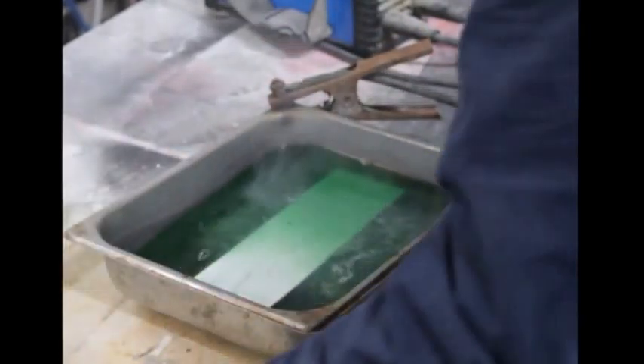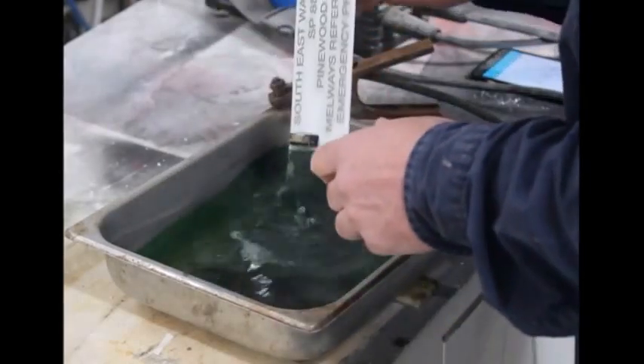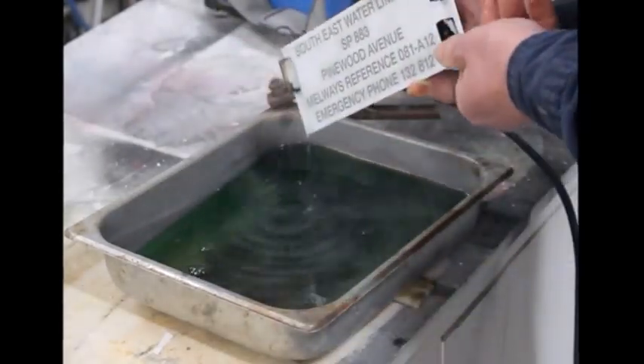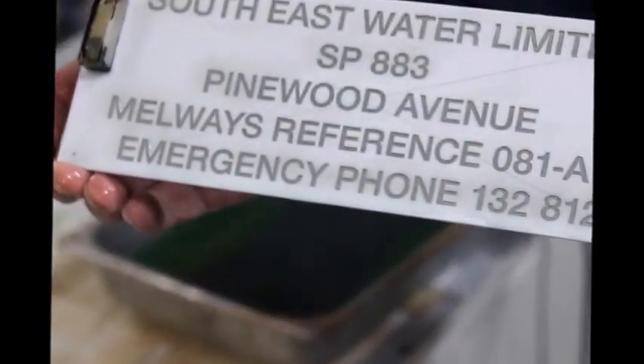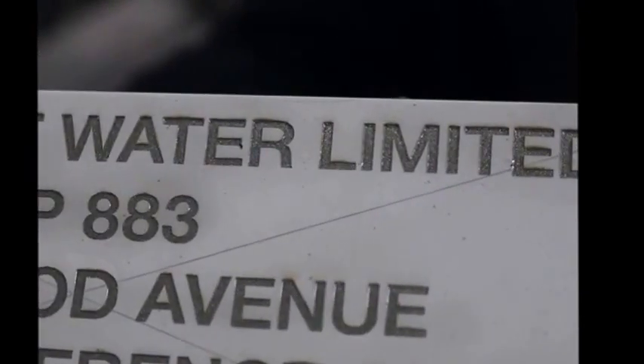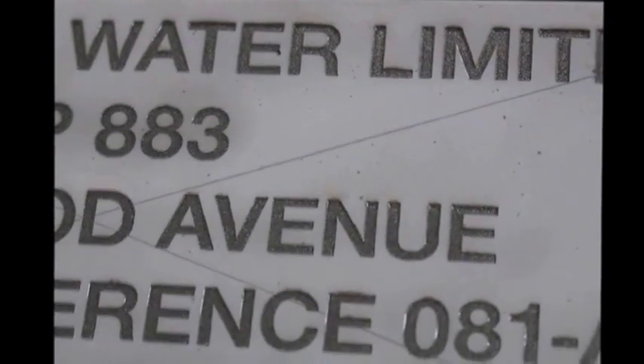After a third minute of etching, I can see that the etching has reached the required depth which is approximately 0.1 of a millimetre. This gives a nice deep etch and it holds the paint well and gives a nice appearance. The bottom of the etch is also textured by this process, which is a really nice appearance for the final product.